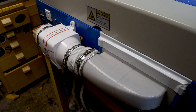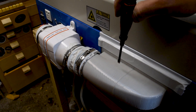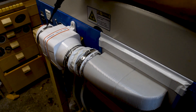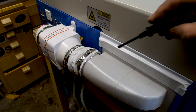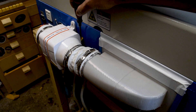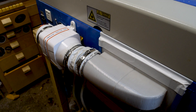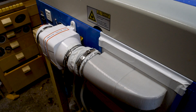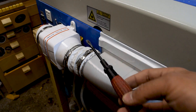I realized it's pretty silly of me to say I'm going to show you how it works - air gets sucked out through here, through the blower, and then out the other side. It's pretty simple. But you can see how it's all attached now. I've locked up this tiny slit up here, and there's a hole in the back that the wires pass through - this hole goes directly to the electronics compartment behind here, so we'll have easy access to mains voltage and we'll be able to place our power supply in there.